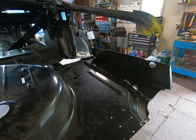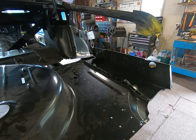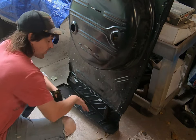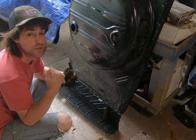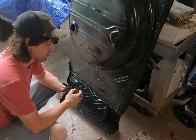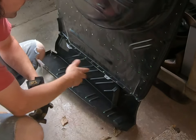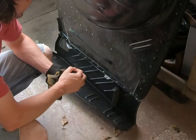What I'm gonna do is stand this thing up on one end so we can weld it horizontally as opposed to welding at this angle. I did use our weld-through primer — you can see some of the gray right here on both sides of the flange. Anything that butts up, you want to use your weld-through primer. We've used it in some of the previous episodes, especially when you have a lap weld — anywhere large sections of metal are going to be covered and there's going to be a weld in there. Some people like to use the copper style, the zinc style was what was available to me, so I went with that. People have their preferences — it's just whatever you feel more secure with.